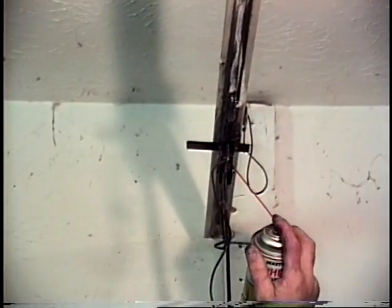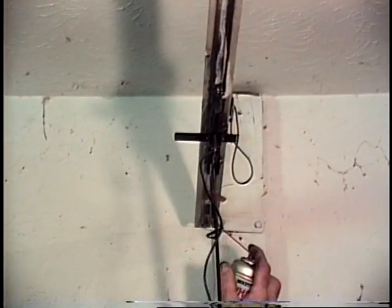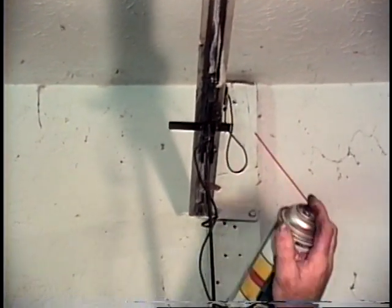Move my ladder here. Chain drive, pretty much the same. Yeah, just clean and grease the chain. Don't use a heavy grease, use a lithium grease. Something that the temperature doesn't affect. So when it gets cold, we don't have to worry about putting extra weight on this.